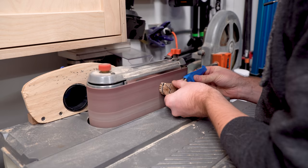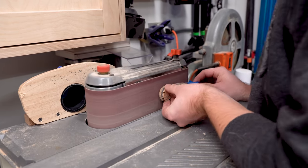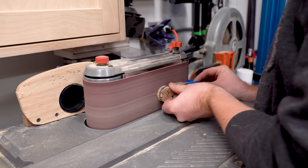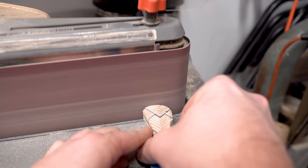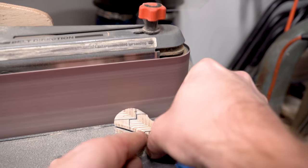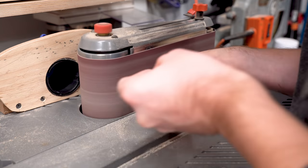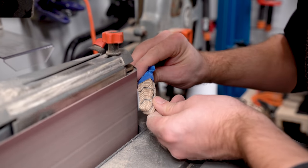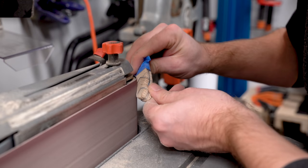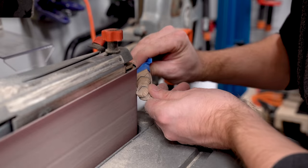After that, it's ready to sand down both this knife and the pen knife as well. So I just ended up shaping them pretty basically on the sander. One thing that is a little bit scary is when you get into that kind of knife lock area, it's pretty easy to put a scar on it with the sandpaper. So I was being extra careful. I don't think I got it, but I got close a couple times. So the pen knife, I kind of left half unlocked, and that seemed to be enough so that little lock area was out of the way of the sander.